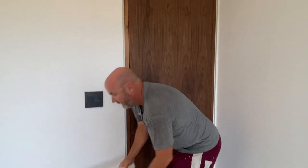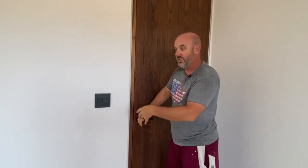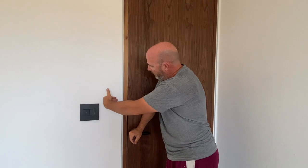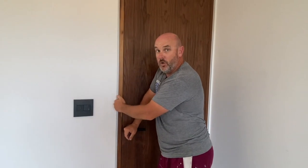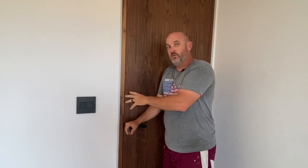Because used to, they would just butt this into the edge. And if that jamb moved at all — if a door got slammed or closed hard — that might show a gap or pop something over here on the sheetrock. So recessing it into the back of the jamb and letting it have some float allows that wood, which is going to be more volatile and more prone to moving than the drywall. So it's a really tricked way to do it.